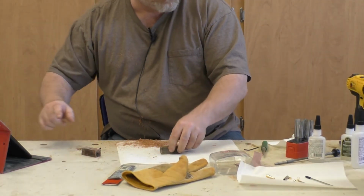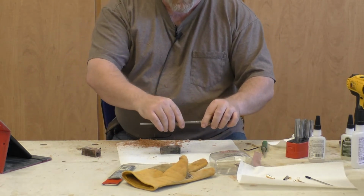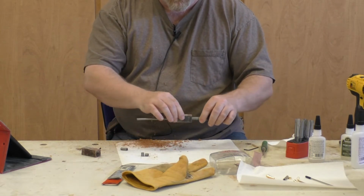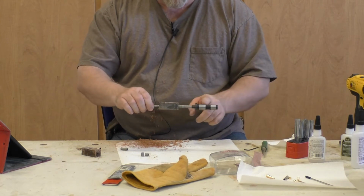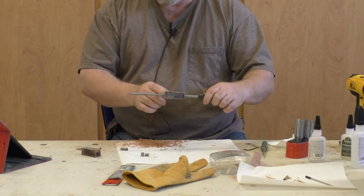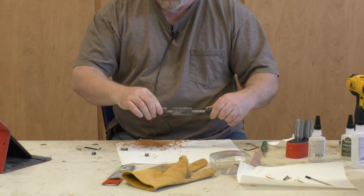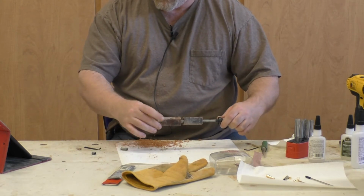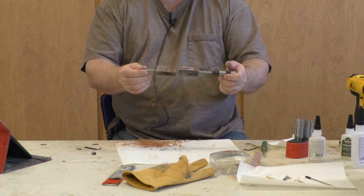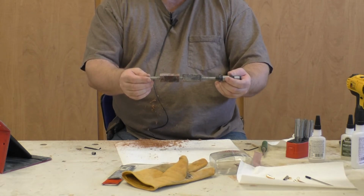So let's talk mandrel. The mandrel is just what goes into your lathe, and it holds the tube. In this case, it is a long piece here where I've got the part that goes into the headstock, some spacer bushings. I put in the first blank, the spacer bushing, the second blank, and then some more spacer bushings. And now we're set up and ready to go to the lathe for turning. So let me stop the video here, move over to the lathe and set up the camera.